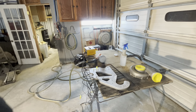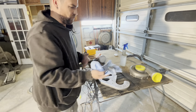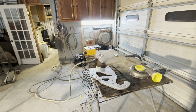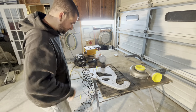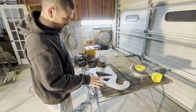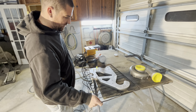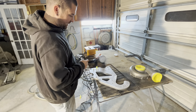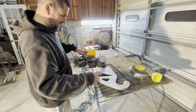Let's wipe this one down too. All I'm using is just normal wax and grease remover that I use for painting. I've stuck a bolt through here to ground this because powder coat requires a ground. I can't ground my oven rack because it's been powder coated so many times it no longer has a ground — there is a way to clean that off, I just don't remember it right now.